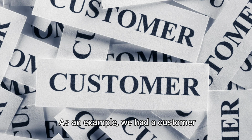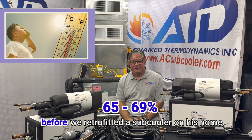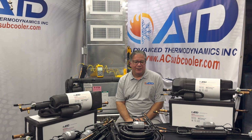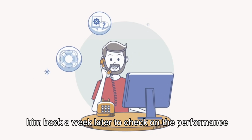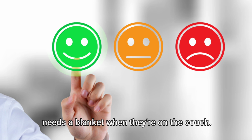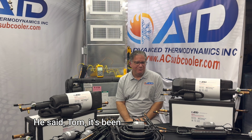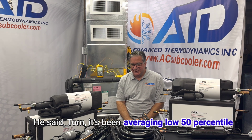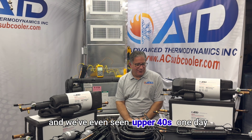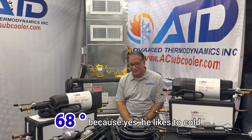As an example, we had a customer whose indoor humidity levels in his home averaged 65 to 69% before we retrofitted a subcooler on his home. After the installation, I personally called him back a week later to check on the performance. He was very pleased and said his wife now needs a blanket when they're on the couch. I asked, "What's your humidity level now?" He said, "Tom, it's been averaging low 50 percentile, and we've even seen upper 40s one day." He said he had been running his home at 68 degrees because, yes, he likes it cold.